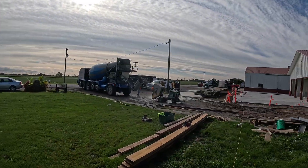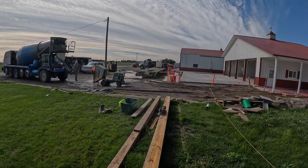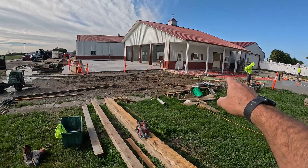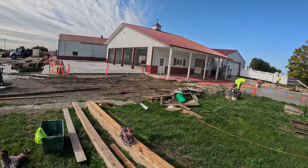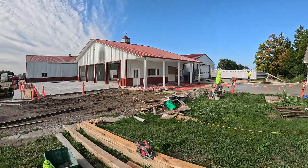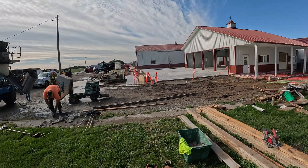The owner doesn't want it broomed again, so we're putting a nice hand finish on this one. Al's getting everything washed up, we're gonna get the machine loaded up. I'm going to grab a pump and put it over there by the drain because that's our low point — going to pump up the water that's underneath the foam for tomorrow's pour. It's not supposed to rain today, so hopefully the next couple days we can make up a little ground for the rain days we've been having.